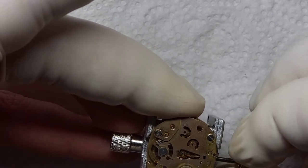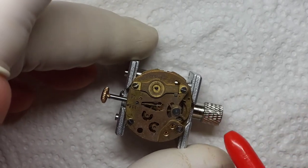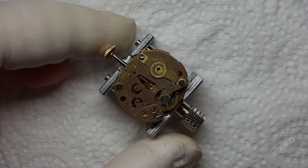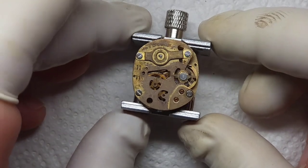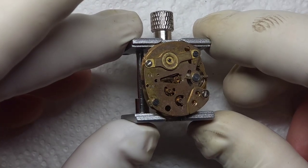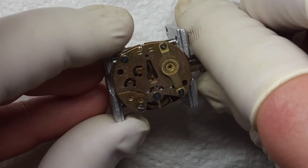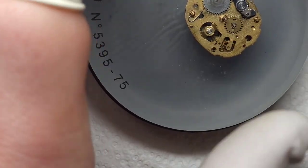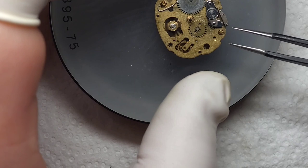With the lubrication done, we can drop that stem back in and give it a bit of a wind. You can see it doesn't look like it wants to do too much - and that's what I was saying about that hairspring being put in too far. It's trying to spring into life but keeps stopping. What I've effectively done is played with the timing of the watch so much that it isn't going tick-tock - it's going tick-tock-tick, which is a funny way of explaining it but it's true. That little dial at the top lets you adjust the timing. All I had to do was pull that pin back out, let a bit of the slack of that hairspring back out, and it found a point it was happy with. It's run at perfect time since.